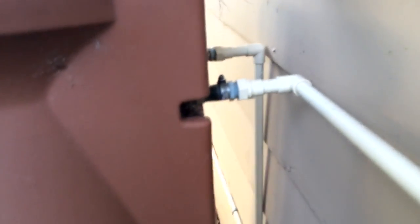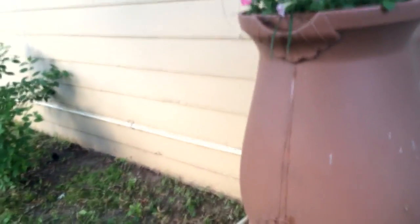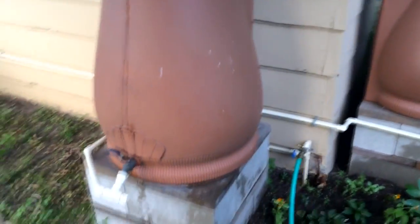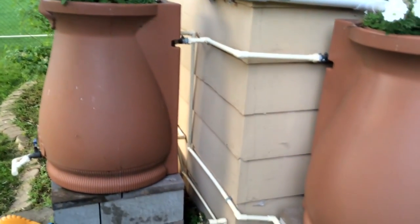These rain barrels do have little screens in them — not super fine, but they keep at least the big leaves and debris out. Since everything is push-fit, I can take these apart, take the barrel out, and rinse it out at the end of the season, which is a good thing to do anyway because it does get some fine sediment in the bottom. It doesn't really get algae — I used to have a clear tube between the two that used to grow algae like crazy, but I don't really have that problem anymore. This system I'm really enjoying and I can use it for a good number of years to come. Hopefully if this kind of system appeals to you, I'd love to see if it works for you — give me a comment below, let me know how it's working, or if you have any questions I'd be happy to answer them.